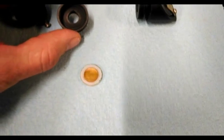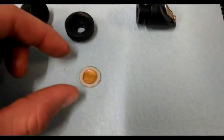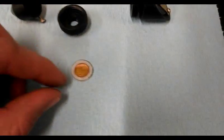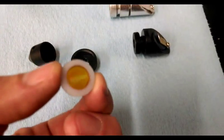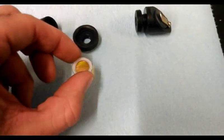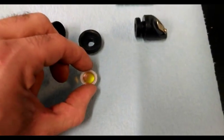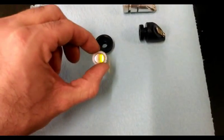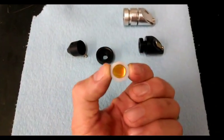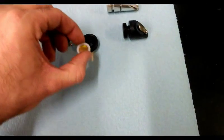The mirror's already been installed in this. The one problem I did have is my lens is 12mm, but the opening for the light object kit is actually 18mm. To solve this, instead of replacing the lens, I took a nylon washer and cut it to size so that it fits around the lens. One benefit is it's much easier to clean because I don't have to worry about fingerprints. Once you have that in and install this, you want to see your reflection in the lens — that's the right orientation, so that's what goes up.